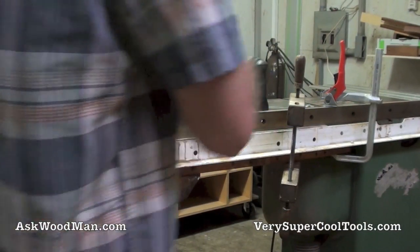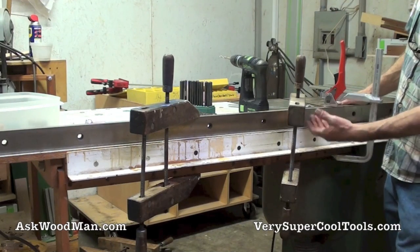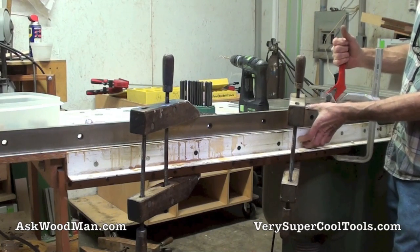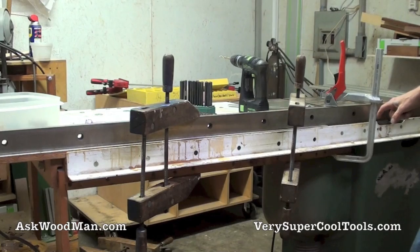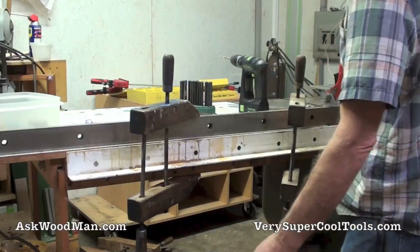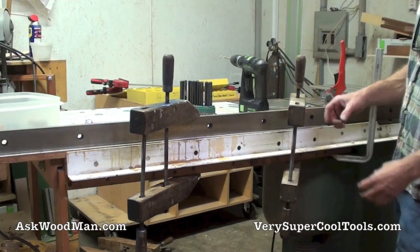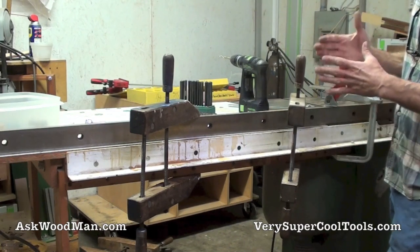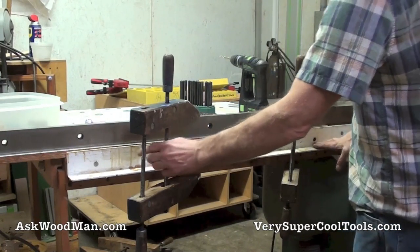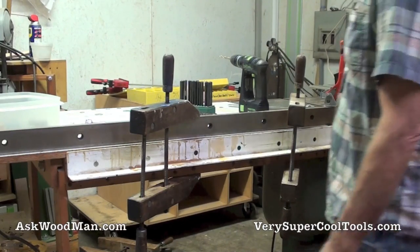This just took me about 10 minutes. I put my big straight edge bar on here, clamped it to the bottom of the cast iron webbing with a ratchet, and pulled this exactly flush in line — all the way flush across the top of my table saw. I ganged up three different size washers because what had happened is it had sunk so far into the wood that it lost pressure and just allowed it to slip. I've got these four to tighten down and then I'll change out the ones on the end too.